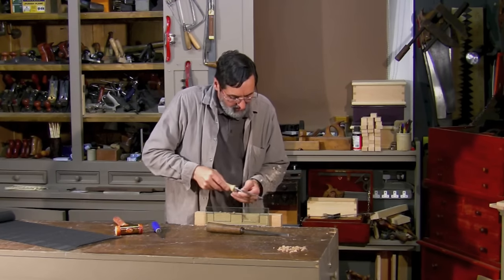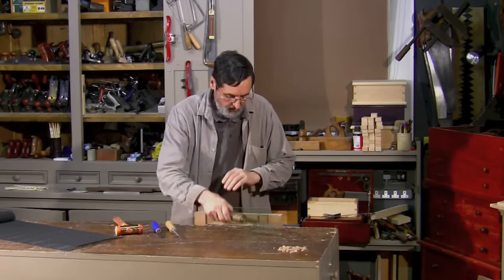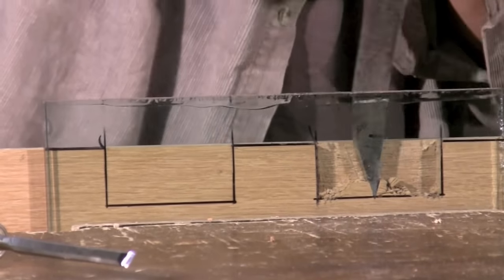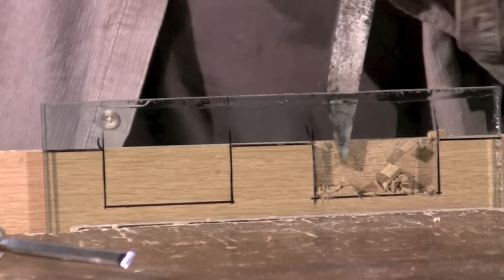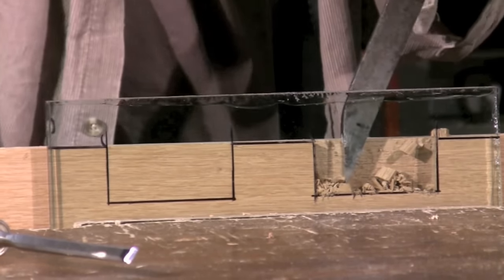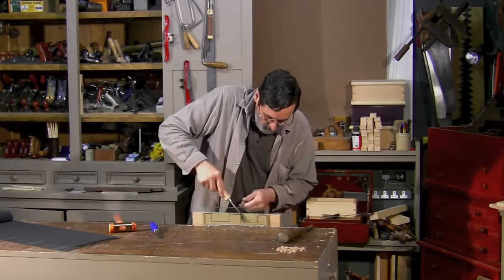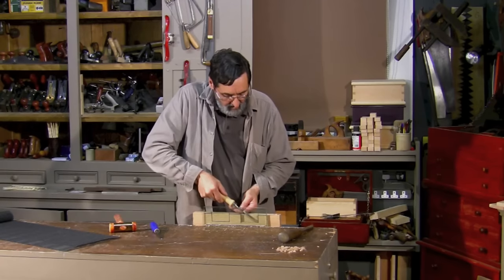There's a build-up inside. You can see that with each chop it goes progressively deeper. With this chisel I ended up with a rise in the middle — I was trying to operate as equally with the chisel as I could. A little tight down in the bottom there, separating the fibres. I find the big chisels awkward even though I'm quite used to them. The corner just needs cleaning out, and that's my mortise done with the three-eighths mortise chisel complete.